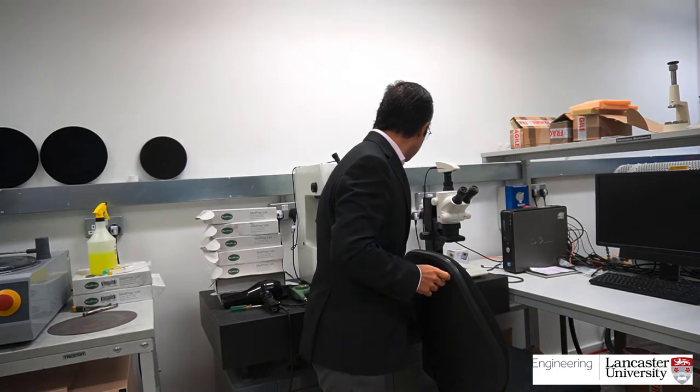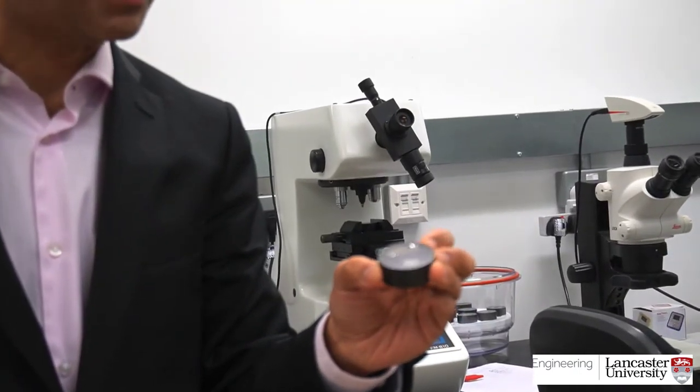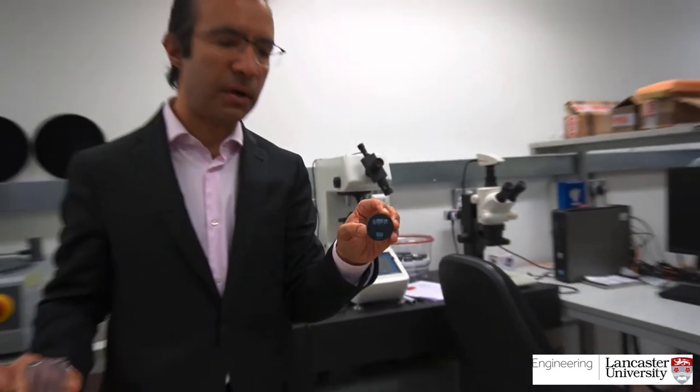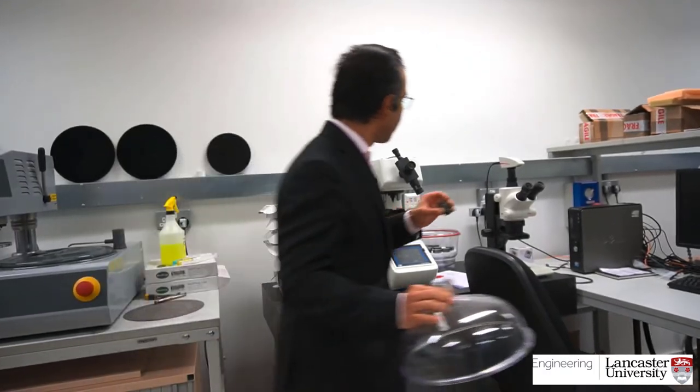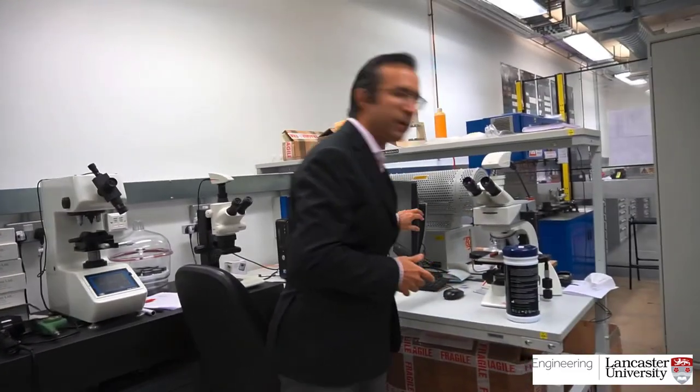The hardness tester works by applying a sharp tip. If the tip produces a so-called indent — a mark that is very large — then the material is soft. And if it's tiny, then it will be hard. We have specimens that roughly look like this. These are the mounted specimens I was referring to — mounted in bakelite, which is the plastic surrounding the grey mirror-like samples that you see here. Often, in order to get to this level of precise specimens that need to be inspected, we would like to have heat treatment on the samples. And for that, right behind the computer, you will see a tube furnace. This tube furnace can achieve temperatures up to 1600 degrees Celsius.